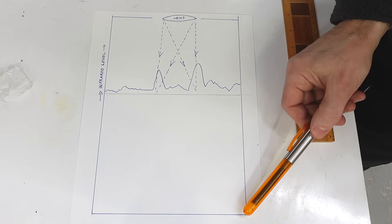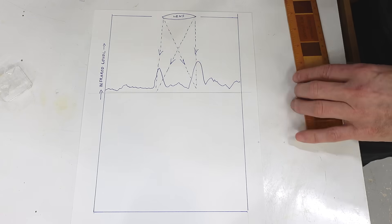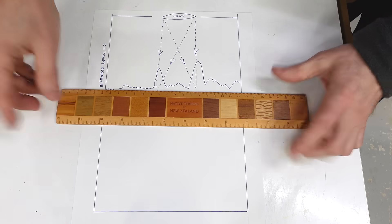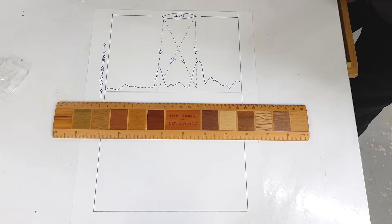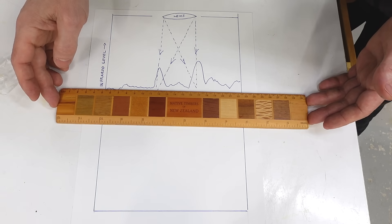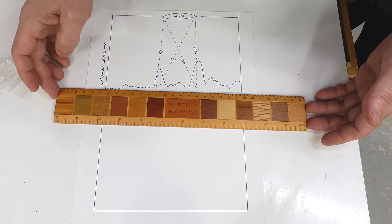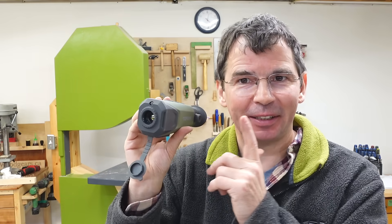The sensor picks up the total infrared — a vast baseline from the camera itself plus a little bit of variation. You look at what the darkest spot is and call that your baseline. But you have no idea if there's a lot of constant infrared coming in because you're looking at something consistently warm, or if you're looking at something relatively cold with just a few warmer spots. By making the darkest spot baseline, you have no idea how much infrared came in through the lens versus from inside the camera — no idea what the actual baseline temperature is. This is why it doesn't give you degrees; it's just meant for spotting warm animals in the wild, not as an inspection camera.